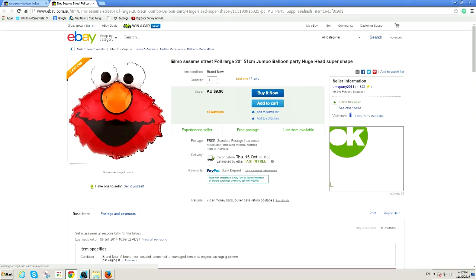Well, it's an exciting new area of the amateur radio hobby. Essentially, you take a party balloon, you know, the kind with the silver backing, and you attach a small payload of less than 50 grams. The payload typically consists of a small computer, a GPS, and a small radio transmitter, typically less than 100 milliwatts. And the transmitter typically transmits on amateur radio frequencies.